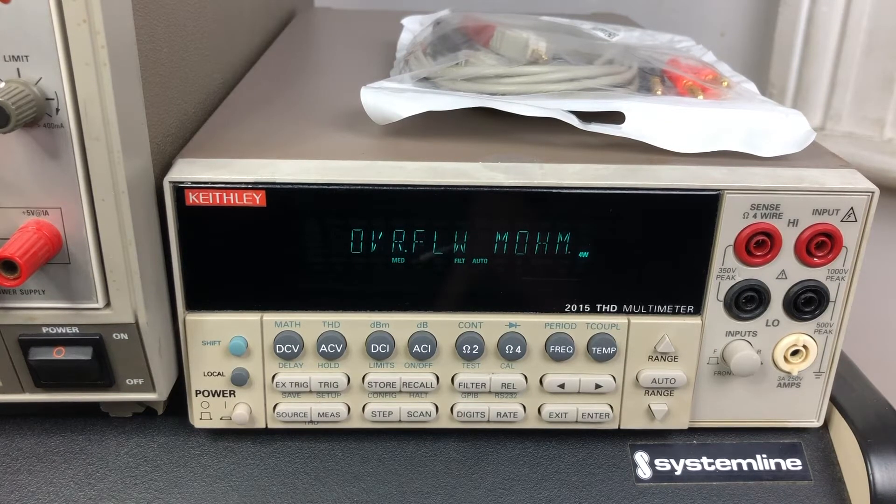People talk a fair bit about the usefulness of milli-ohm meters in electronics, especially in debugging when you're trying to find a short, because traces will have a resistance. So the closer you get to the short, the less the resistance will be. But you can't measure that with a normal multimeter because the resistance of the leads themselves becomes quite significant — so you cancel that out by using 4 leads.